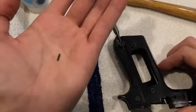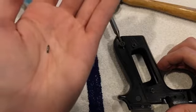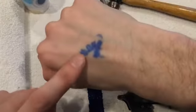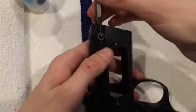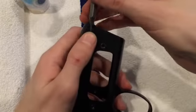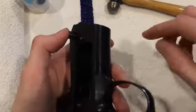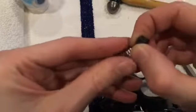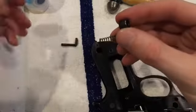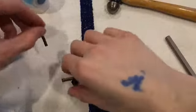The pin you just hammered out is very small and is very expensive. Happen you bend it and break it trying to reinstall it. Take care and caution. That's from the gun show today, the little blue marker they give you. That's where we had to get another one from my friend that broke his. Anyway, so you can hold your thumb over the push the button, slowly release it. Out will come the button, spring, and the magazine retainer. Put that in our cup, set that aside.